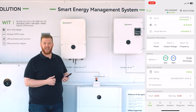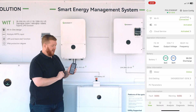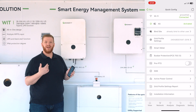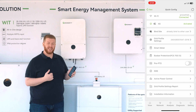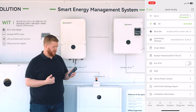Below that, we also have things such as our input import/export metering and other grid control parameters. In order to configure the hardware, we're first going to enter in the top right hand corner under quick configuration. Here you'll have quick access to things such as networking, ESS and EMS battery modes, grid profile settings, smart meter communication for import/export limitation, or zero export with your grid utility.